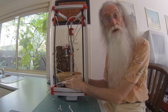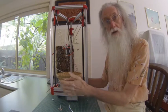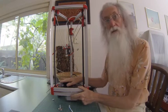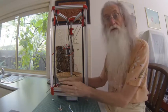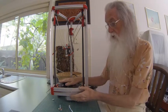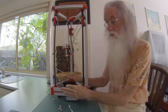So if you do a wire count, especially if you look at the high current carrying wires, it's probably easier having the electrics on the bottom. The power supply is a large one and it is awkward to fit, and it's uncovered. So I've decided to put the electrics on the bottom, including the power supply. So that meant changing the feet design.